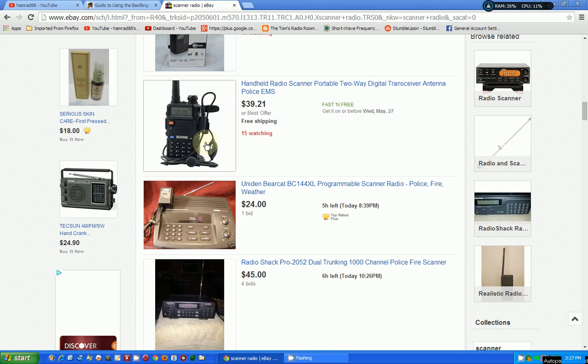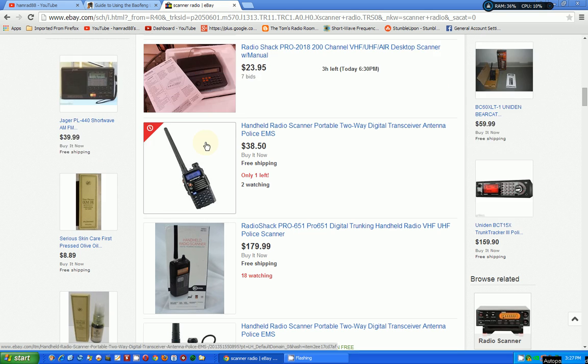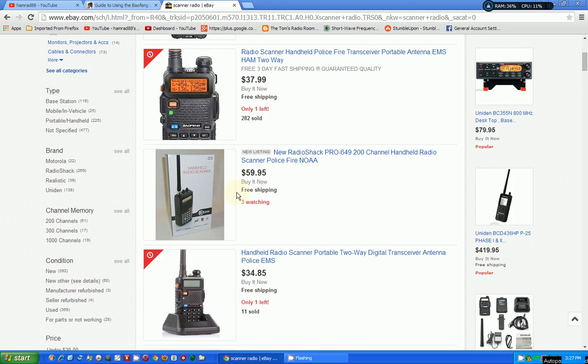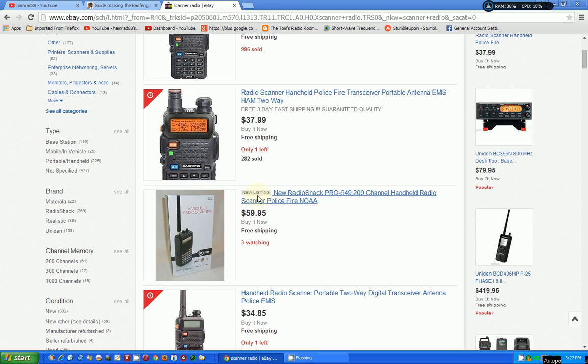Now, granted, it was not designed, I shall say, for a wideband scanner. So that's one drawback. But the question is, and this is what I'm looking into, it does give you the capability of using a pretty wide band as far as what frequency you put in. Supposedly this radio is only certified for the 2 amateur radio bands, the 2-meter band and the 440 megahertz band, or 70 centimeter, but it will receive a much broader bandwidth than just those frequencies. How well? That's another thing I'm going to investigate.